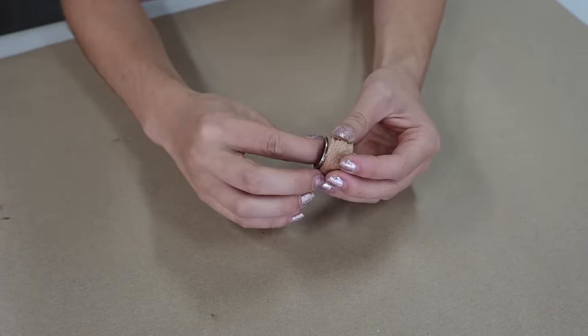So I bent it out into as straight of a line as I could get it and then hammered it into place. And then once it started getting hard to hammer and hard to shape, we just re-anneal it. And now with my newly straight and newly annealed piece of copper, it was time to head over to the rolling mill to start drawing it out into a longer wire. This is a pretty simple machine.